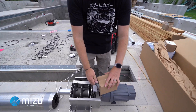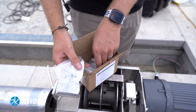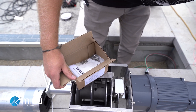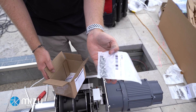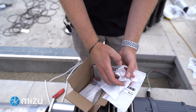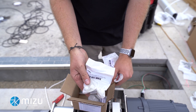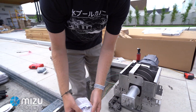In our hardware box, let's crack it open. Inside, a couple of different things. We'll have some machined Phillips head screws and three-eighths nuts — we'll use those for attaching the arms. Some extra carriage bolts, nine-sixteenths bolts and lock washers — this is what we'll use to attach the tube. Small self-tappers with a five-sixteenths head, medium self-tappers, five-sixteenths stainless steel screws with molly bolts to anchor the system into the wall, some extra bonding lugs, and some rope guides. To attach your tube, you'll need your split washers.